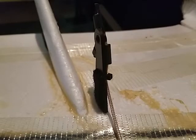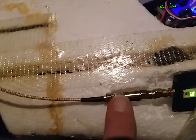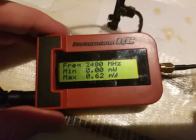All right, so in my mess here, I've got a low power TP-Link, high power card, 30 dB attenuator, measured 0.7 milliwatt output. Actually, let's test that again. I measured it yesterday. I want to be sure. All right. Data rate of 4, 30 dB attenuator, and 0.6 milliwatt on the transmission side.